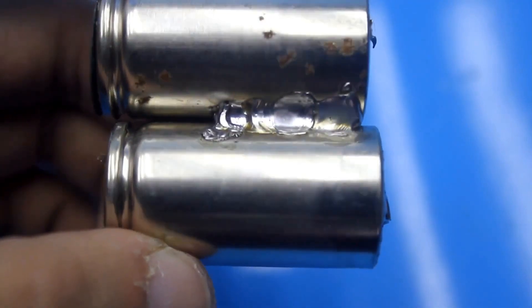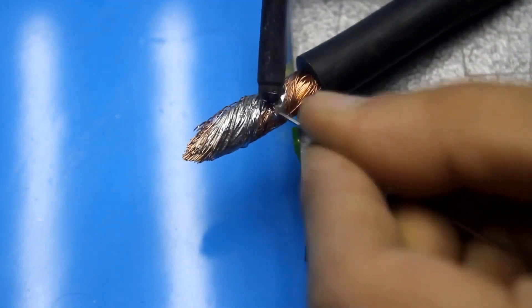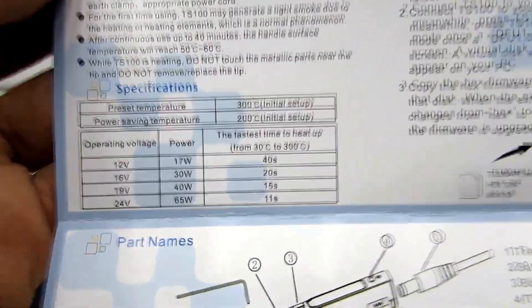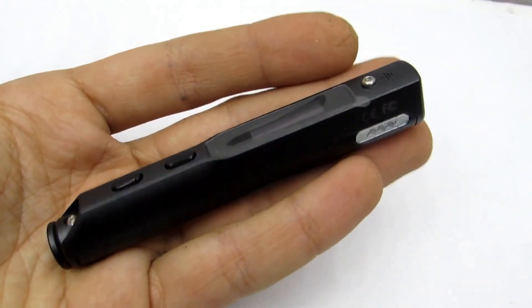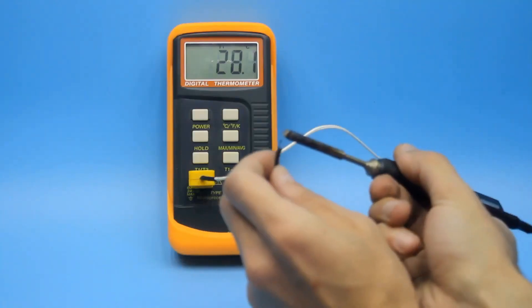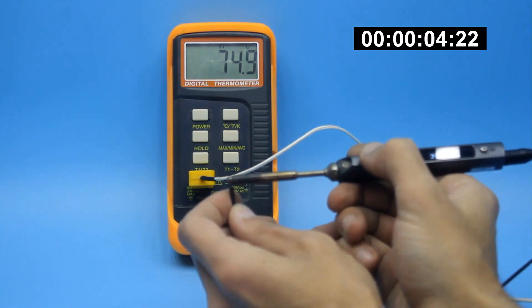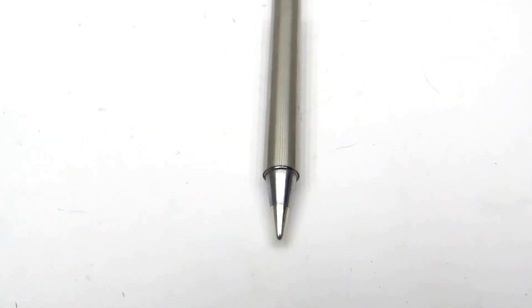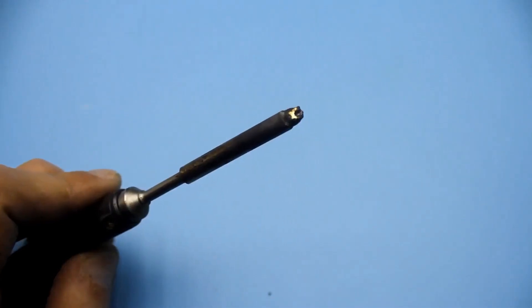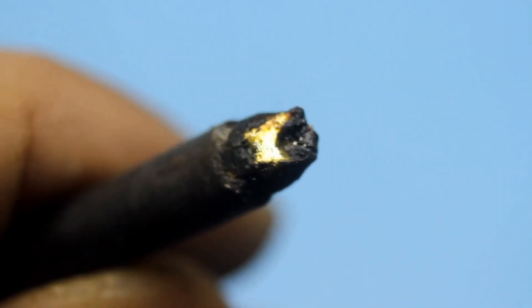This soldering iron is sufficient for absolutely any electronics hobbyist tasks. Even a 100W soldering iron would envy this little guy. The TS-100 heats up from 0 to 300 degrees in just 10 to 12 seconds — faster than any other soldering iron, at least several times over. The power supply voltage range is from 12 to 24 volts; naturally, the lower the supply voltage, the lower the power and the longer the tip heating time. The original tips have a non-stick coating and will last at least a year if you solder as actively as I do, or a couple of years otherwise.